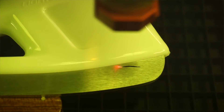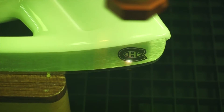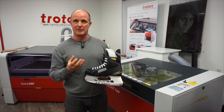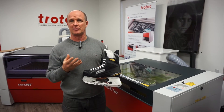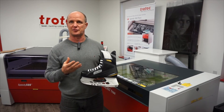For the blackest mark, typically we want high power and most importantly we want to go out of focus. Going out of focus will allow us to draw the carbon to the top of the metal, and we will not actually remove any metal material. So when you feel the actual mark, it'll be perfectly smooth.